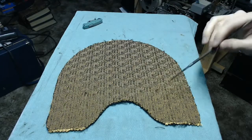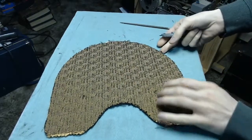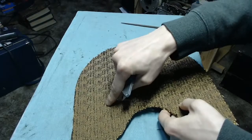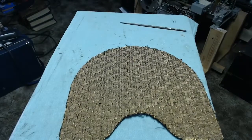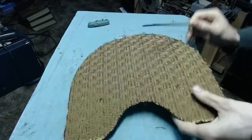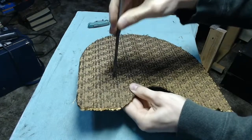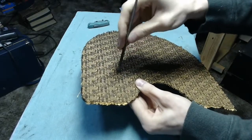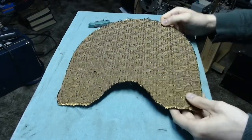So to actually get these in here without damaging the surrounding material, what I did was I used a very, very sharp knife here, and I located the holes on the back by just running my thumb or forefinger over until I found the depression where each one of them is, and then I gently pressed in with the tip, and I produced an X shape over the top of it, a small puncture, and then I used the smooth end of this round file here to gently get into that hole, break up any fibers that are in the area, and then gently push through until it's the right size. I didn't want to use this side because this grabs onto those fibers pretty easily and pulls them out and makes a mess. So now we have our 4 good holes in there, and now we need to see what this looks like installed in the cabinet. I'm excited for that.